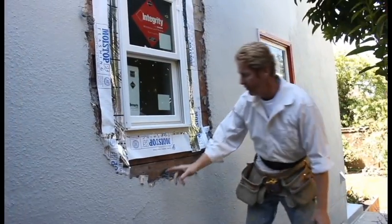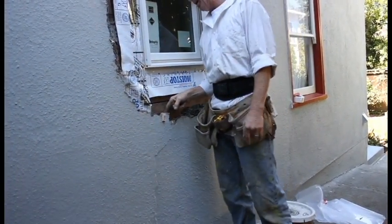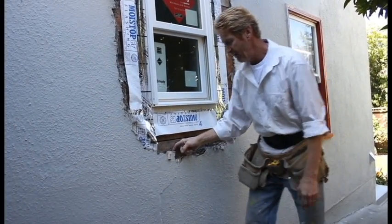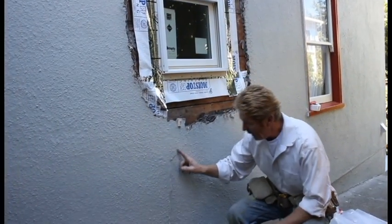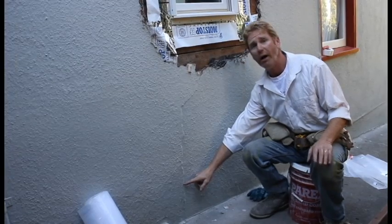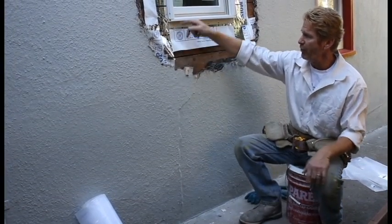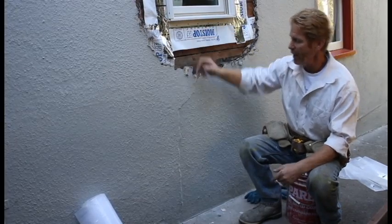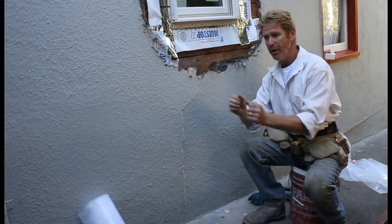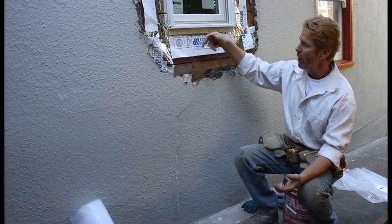What I really wanted to show is this. The homeowner came out and I was just looking down here — I can see there's no paper here. This is pulled away from the wall a half inch. I see this buckle right here. This buckle separates a quarter inch to a half inch. There's no paper here, so this was a problem area. Water went down here, swelled the wood. When the wood swelled, it pushed away from this stucco. It swells, then it shrinks back. Now that creates a path for the water to go in.